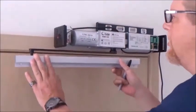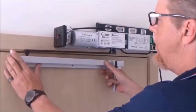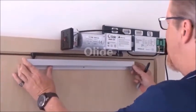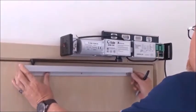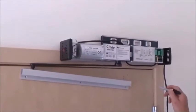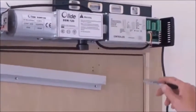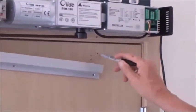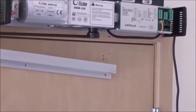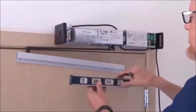We're ready to mark and mount our track on the door. I let that arm determine the elevation of my track, and this one sits rather snug. For the book, the dimension is 6.3 inches from my hinge pivot line to the edge of my track — so it'll work right at six and a quarter. We want to be level.